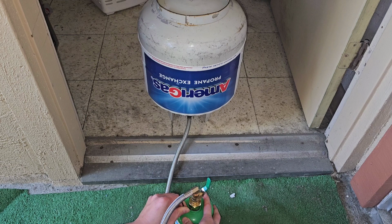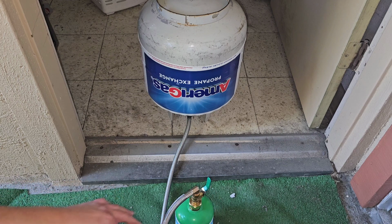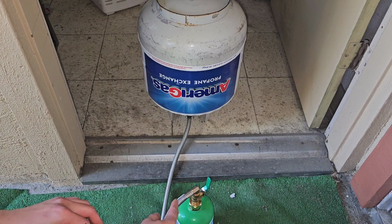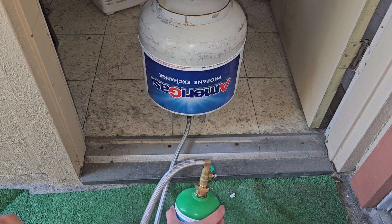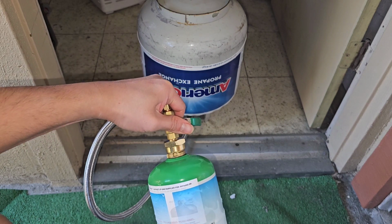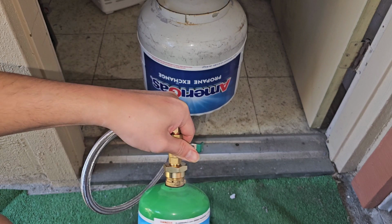But honestly, that's not really required, because when you open your gas, it'll expand and push the air out. It's just your thing won't light right away if it's just pushing air. So after we bled it a little, we're gonna shut this. We're gonna take this canister off here. It might spray a little bit of the cold stuff out, propane, so hold on to this, twist this. Depending which valve you got, it might open and close differently.